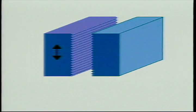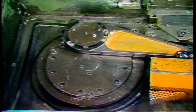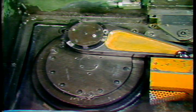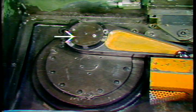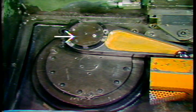Die match may be accomplished in two ways. First, one die may be raised or lowered to align the thread forms. Second, one die may be moved ahead or back, which changes the relative position of the thread forms at the start of thread rolling. The second method is normally used on the Hartford thread roller, accomplished by the eccentric on the end of the Pittman arm, which adjusts the moving die ahead or back.